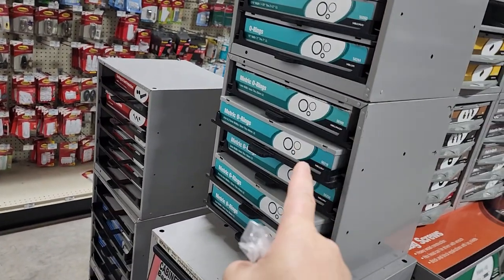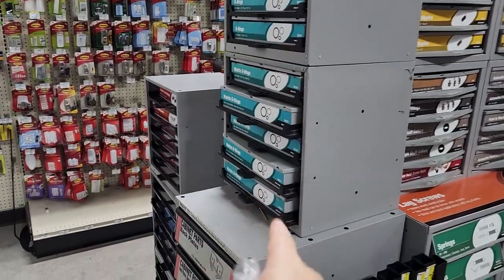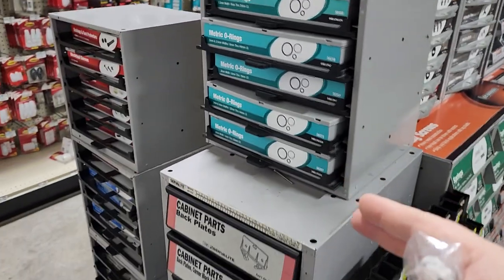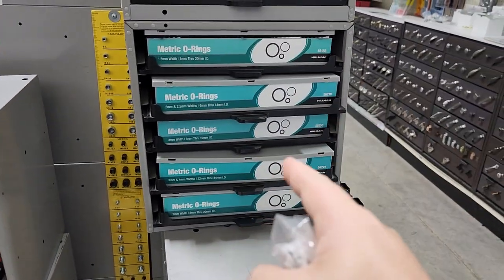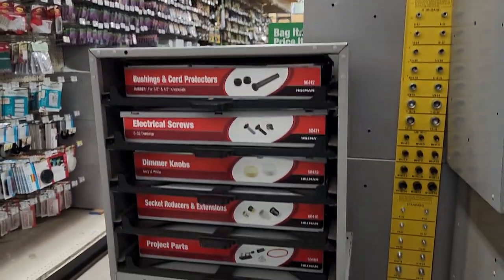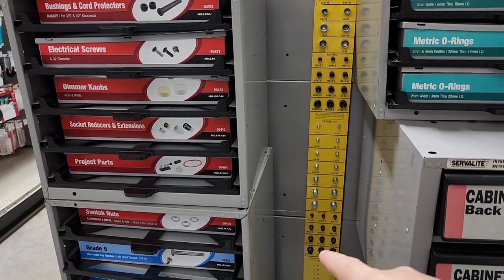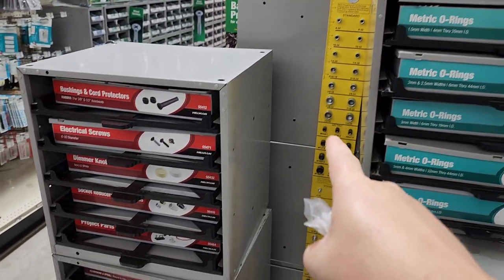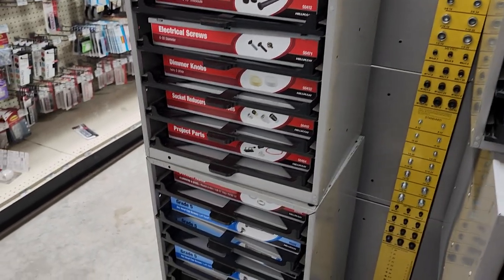O-rings — this is one of the big things that you're going to use your local hardware store for. There are multiples: these ones here say they're metric O-rings, but they also have high temperature O-rings. There's a variety. So don't just replace it because it's the same size — it has to be the same type of material. They also have a chart so if you need to size up a fastener to figure out what it was. I use my tap and die set, but if you don't have one, you can bring it to your local hardware store, thread it on, or screw it into a hole to figure out what thread it was.